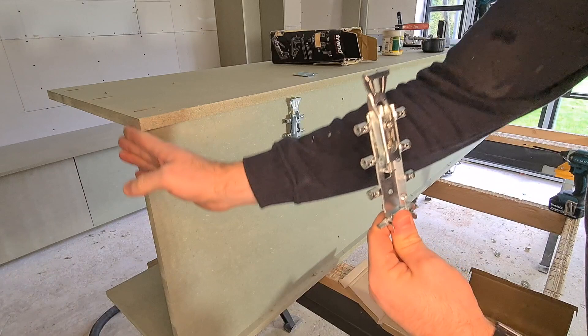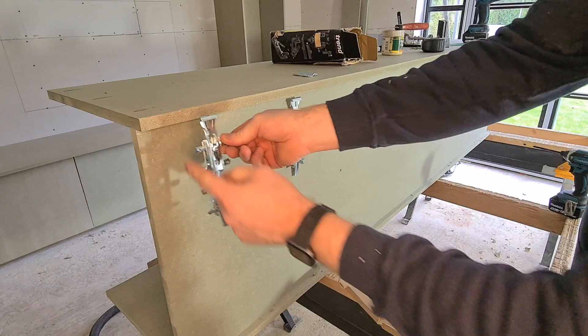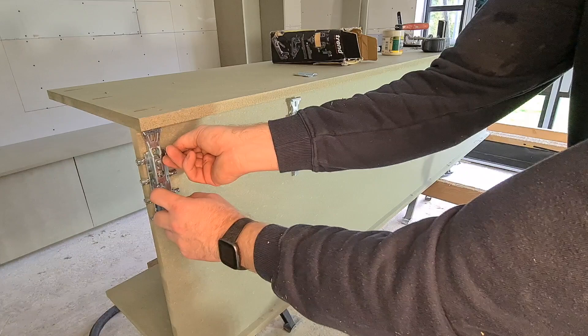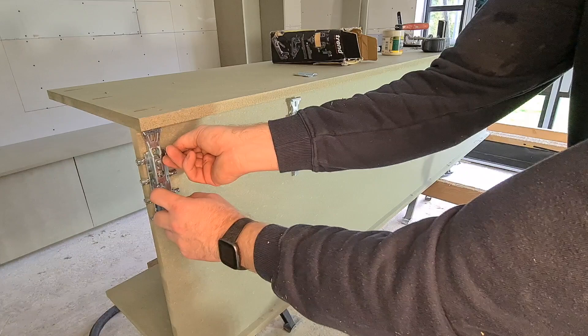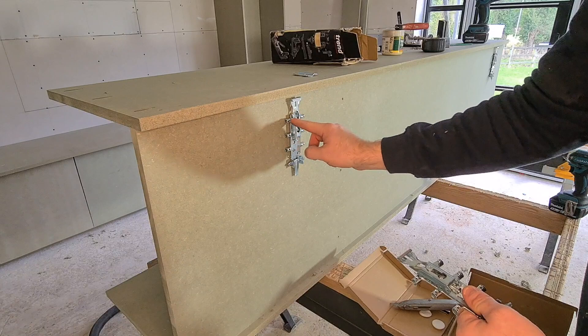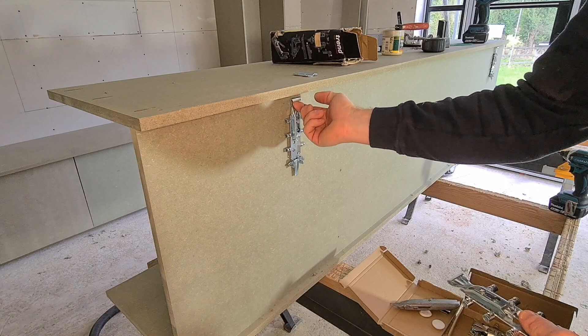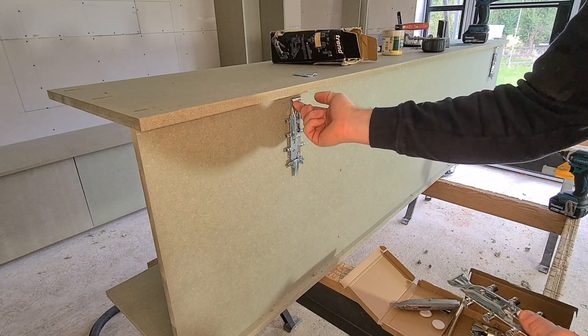On a different application where you've got a sidewall to your wall hung unit, these three pins here actually get drilled into that sidewall. Then this part goes into a fourth hole which is slightly smaller, and you'd jack that down and it would push it all up nice and tight. Unfortunately with this one we haven't got the sidewalls, so we're going for a face-fitted one. But what I like to do with these holes that are then useless is find a screw that will fit through there and just screw it in at every point, just for that added strength, because these two screws here aren't enough really when you've got the whole pull of that unit trying to come off the wall.